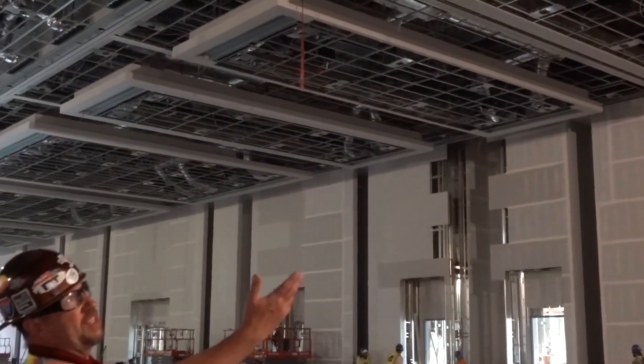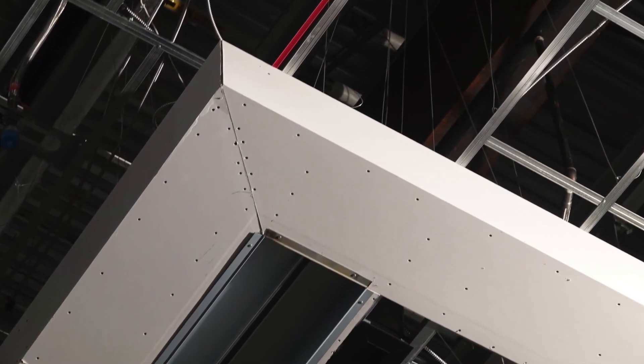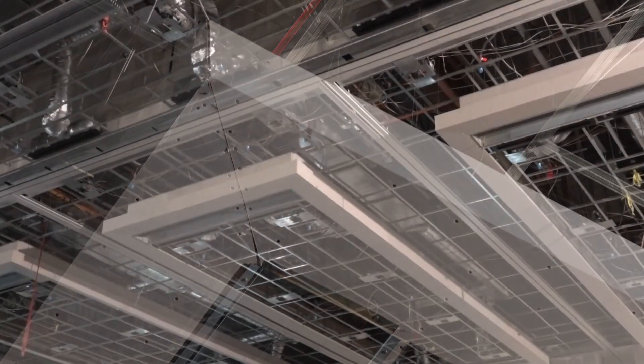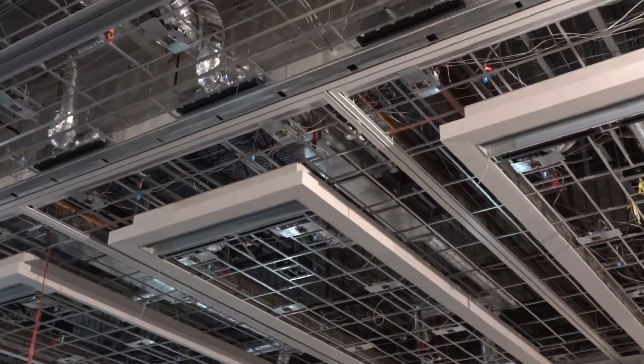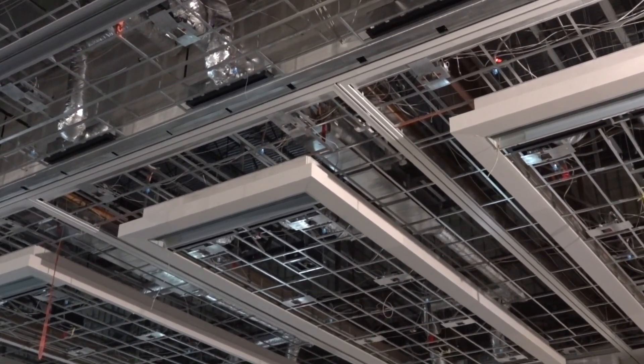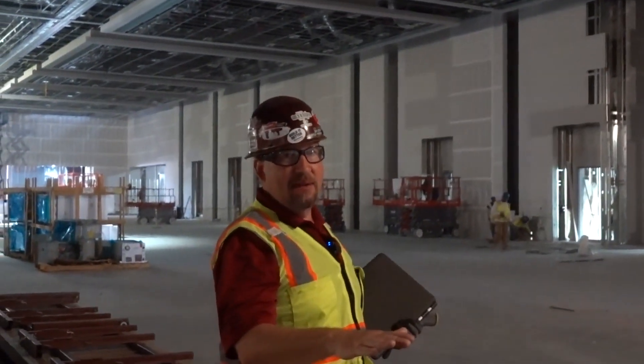Here's a great example of why you want to use the mitered drywall with the drywall grid system. You can see they put all their mitered drywall on with factory edges, so then they can have one crew jump on the job and get all that finished. The MEP work can all be done simultaneously. And then they final hang the bottom board, finish the bottom, and they're done.